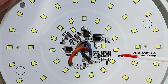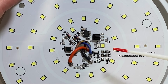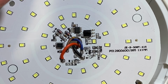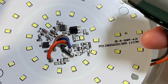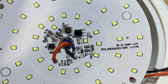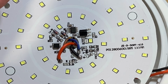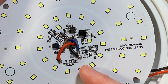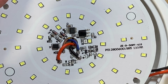So what do you see or not see? Charge control, the lack of it. I had this up at 3.65 volts, which is the maximum that you should charge one of these lithium iron phosphate batteries to, and it kept charging. I set it on a power supply, and also when you leave it to just discharge, it ended up at about 2.2 volts with these LEDs still glowing faintly. So it just runs this battery down till the LEDs stop conducting. I don't think that's very good for one of these batteries.